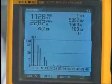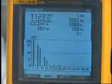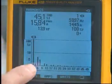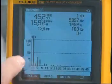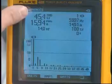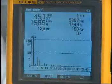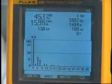Let's switch now by putting the DC link choke back into our drive. We can see how dramatically the 5th and 7th harmonics have dropped. Now we see our 5th is about 30% of our fundamental. Our harmonic currents now total about 45% of the fundamental, which means that for 15 amps of fundamental current, our harmonic currents are about half of that, or about 7.5 amps.